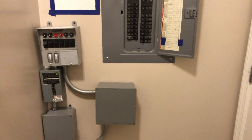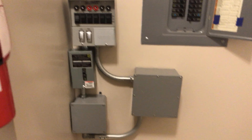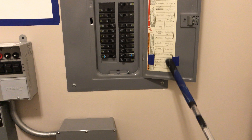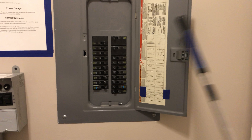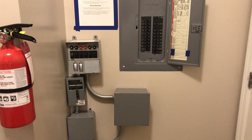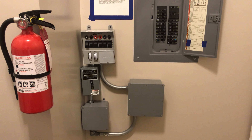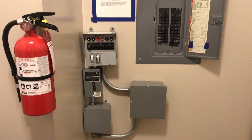So to summarize: the 30-amp breaker powers the inverter in the garage, the inverter returns voltage back into these switches in gen mode, and power flows back into the house circuits. I've identified circuits covering anything with lighting, the garage door opener, microwave, refrigerator, and a few other things. The only things without backup power are 220-volt appliances. The system works flawlessly — when power goes out you don't even notice it. TVs, computers, and usually even internet stay on, and it all switches back seamlessly when utility returns.